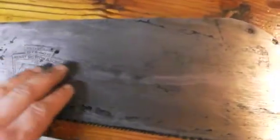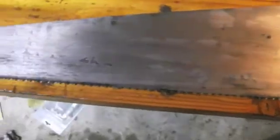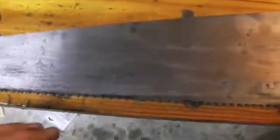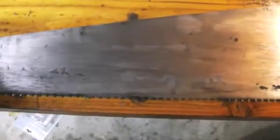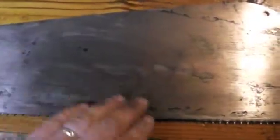The 220 sandpaper is going to leave a little bit of these striations in the metal itself, so you're going to see some of that gouging from the sandpaper. If you want, you can continue with the 320, and that'll relieve some of that. It's also a good idea, if you're going to continue to sand around your engravings, to make sure you're using a lighter sandpaper. You can see I kind of came in a little bit closer on these teeth down here to get as much of that as I could with the block.